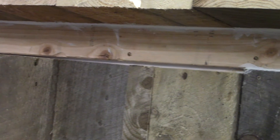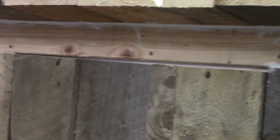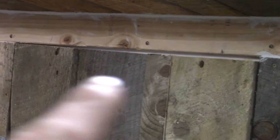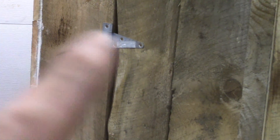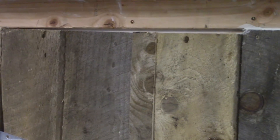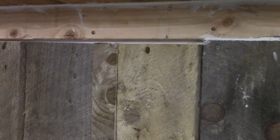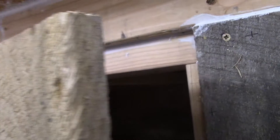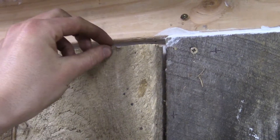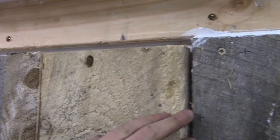On the top of the door it's not quite square. I think that's due to me not putting all the door pieces together square, because along the edge of the door on either side, it's very square. That part there is just a rough edge, that's why it looks like that. So I just don't think that door is made perfectly square. But that is why I left the exposed 2x4 here for the door to close against, to accommodate for errors in measurement and situations like this.